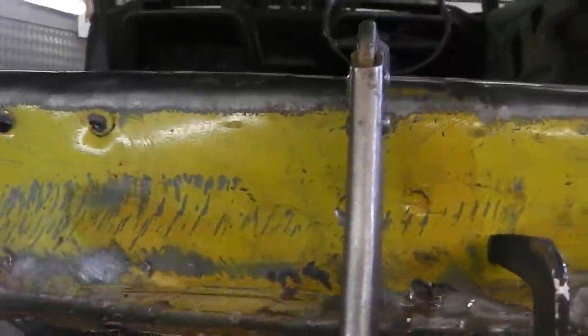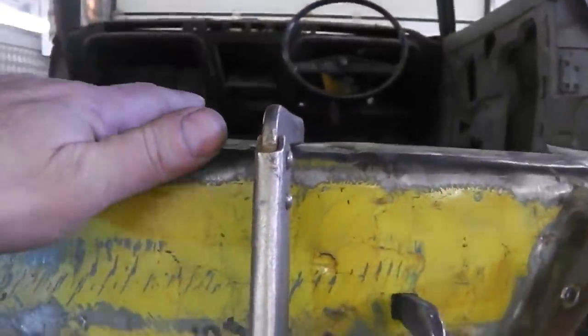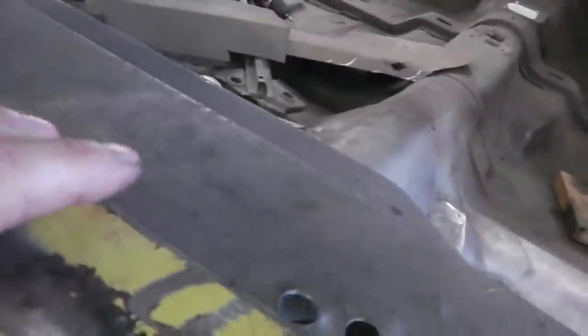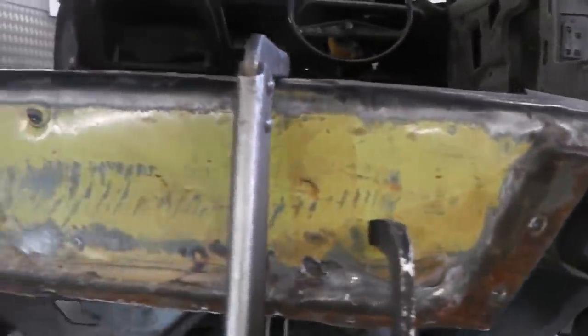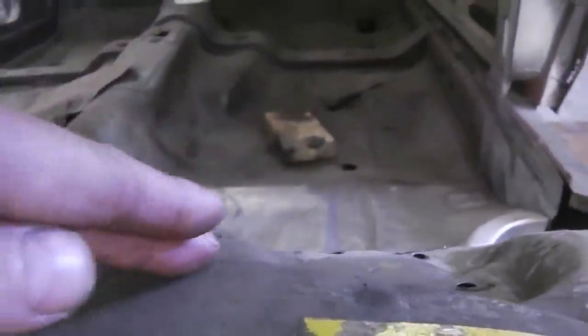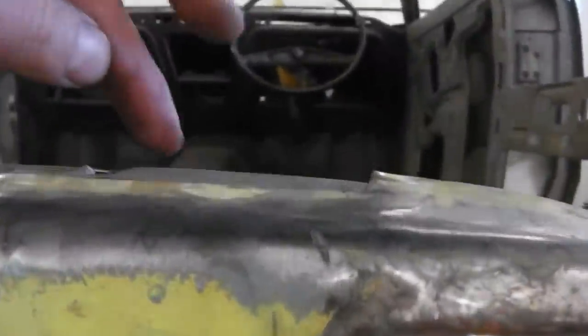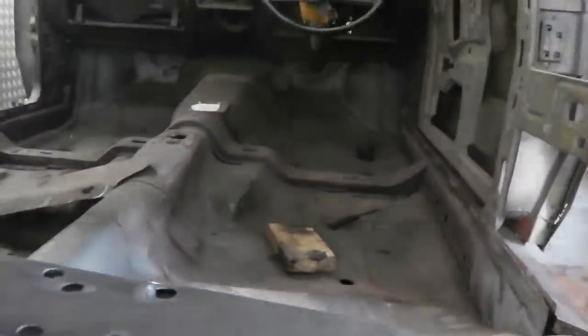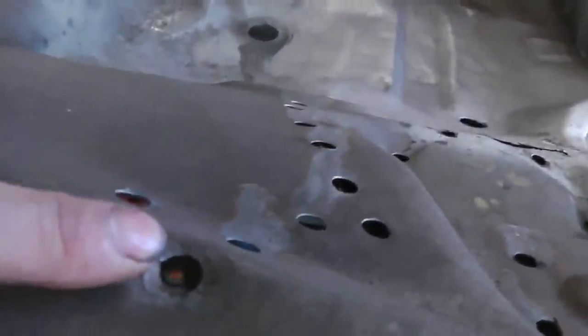And now I'm clamping this, the end of the floor pan. And it needs to graft its way in to the floor pan. This is the repair section, but before we do it, we need to know the exact position. So if you fit the chassis leg and you're happy that it's in the right place, which it is, luckily, we can tuck the chassis leg inner bracket into this corner, knowing that that's where it sits. I'll show you what I mean. There's an inner bracket here, touching it now. That's got a sort of right angle on it which fits snugly into the original floor, so that gives you the position of the chassis fore and aft, which indeed lines up with these welds, look, where we drilled out.